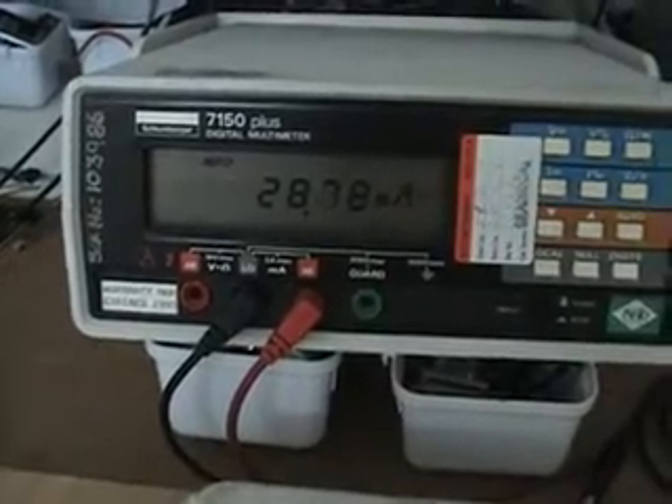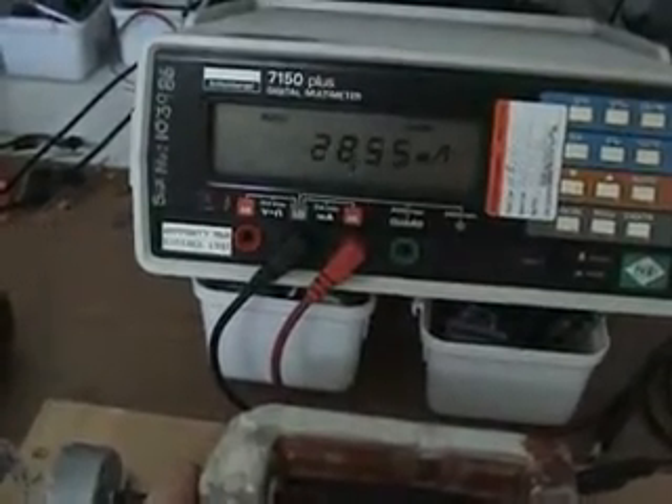That's really interesting. This motor configuration using a permanent magnet as a rotor — instead of a steel rotor like in an induction motor — makes a motor that under load actually takes less current. If I put my finger on there and add a little drag, look — it drops. I let go, it comes back up.